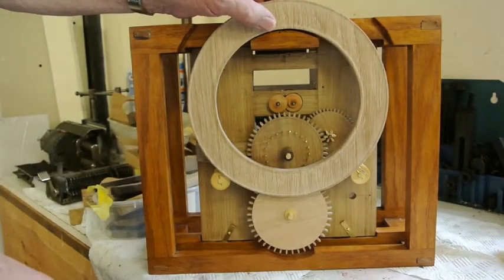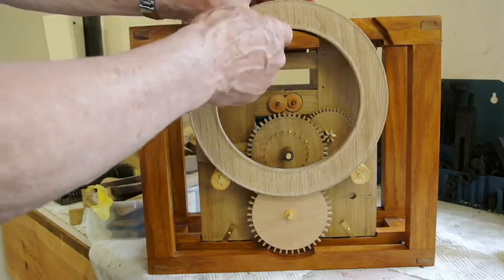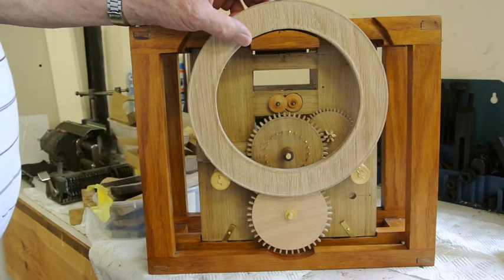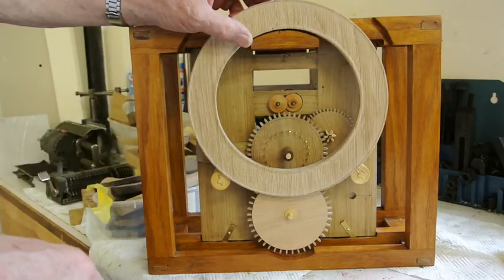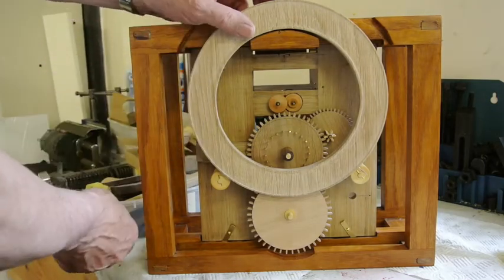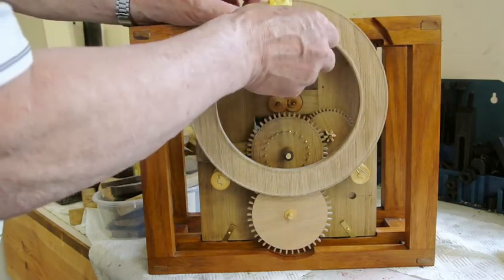The only thing I don't like is the way that the top of this requires something to hold it up. On the clocks I've seen in the British Museum there's like a little brass elbow that sticks up here, and I think that's rather an inelegant solution. If it was me I would have had a roller of some sort running in the groove here — I'm going to think about that. I'm sure Harrison would have put it there if he had the choice. In fact none of his clocks are completely original; they've all been tinkered with over the years.